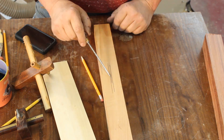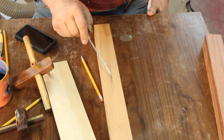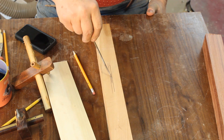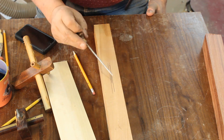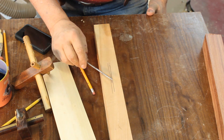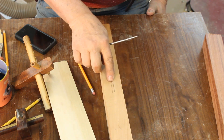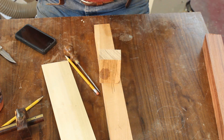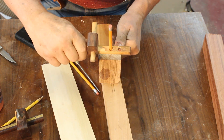Making this little indentation is a good idea when you're starting to drill a hole. With my birdhouse ornament I made a couple of holes in line, and that's very important because you can't drill those holes on a round piece of wood — you want to do it when it's square so you can find the exact center.